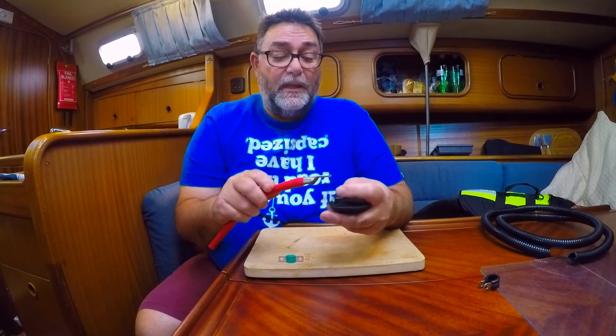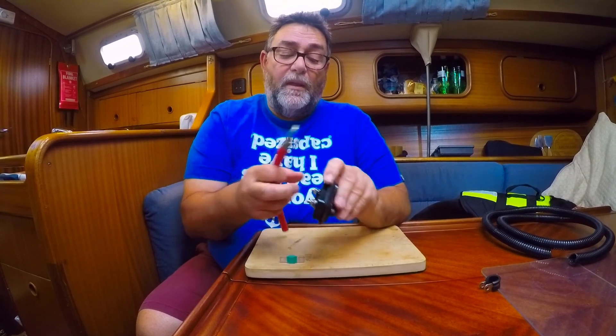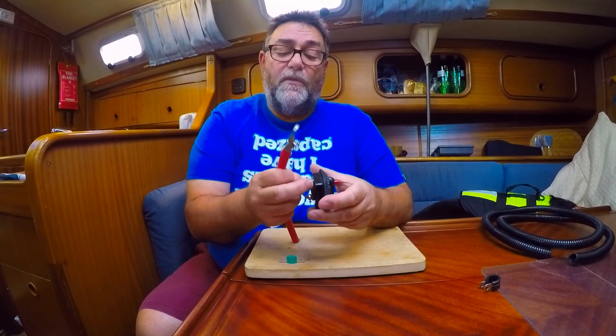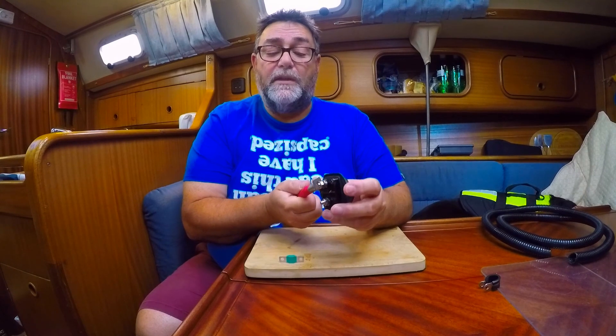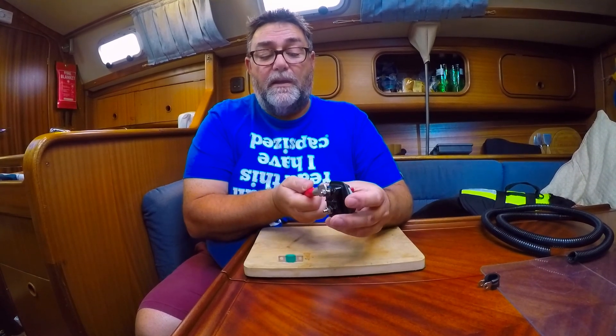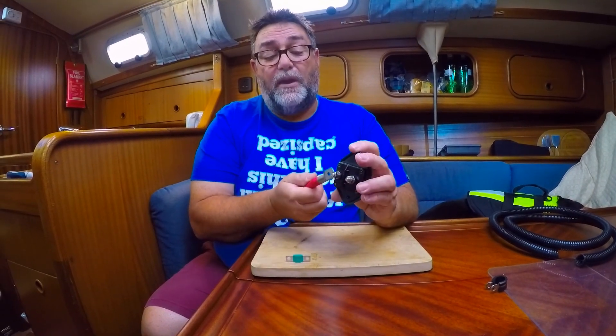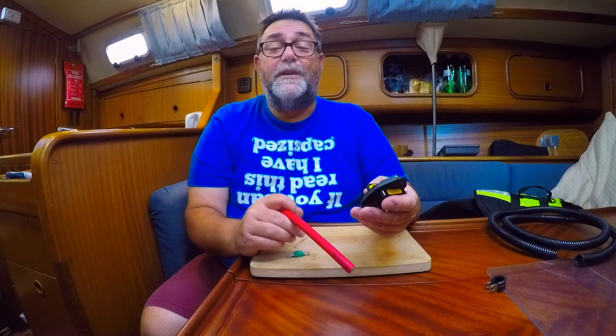These have lugs on the back — I've already said this is a 6mm. Use the manufacturer's recommended torque settings on these studs. Don't over-tighten or under-tighten them — if they become loose they'll get hot and it could cause a fire. If you follow that sort of rough guideline, you'll have a successful installation.